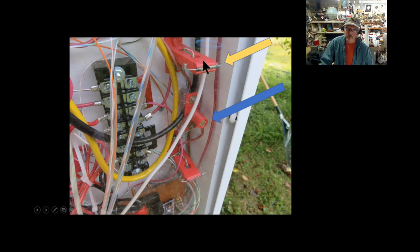And these reed relays, all I have is a magnet attached someplace on here, and I can pull that magnet off here, and when I get it close to this reed relay, it makes the switch. And in this case, the yellow one means it will sit there for a second and say, okay, door open. It plays a little tune on the piezo buzzer, and it plays a different tune down here when it comes to the door down here too.